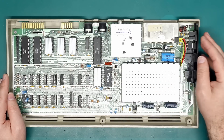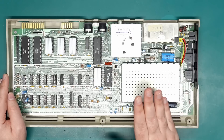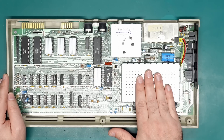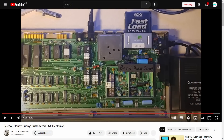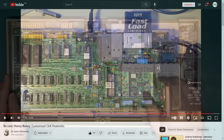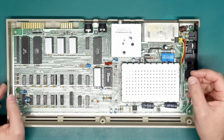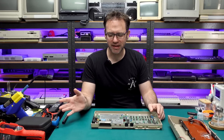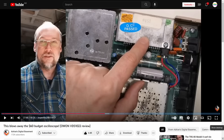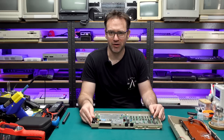That's the only modification I've done so far — I just ran wires to the original holes on the board for the voltage regulator. I did also think about mounting this to the VIC-2 can; I know that Dr. Dave did a similar mod where he actually put a metal strip there — and I think there's a Pulp Fiction reference on that — but I don't want it to get in the way every time I want to open the VIC-2 can. This mod was more like one I saw on Adrian's Digital Basement, where the voltage regulator was stuck to the cartridge shield, and it seemed like a good idea.